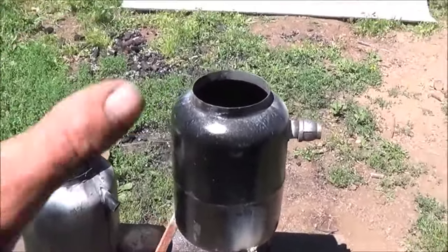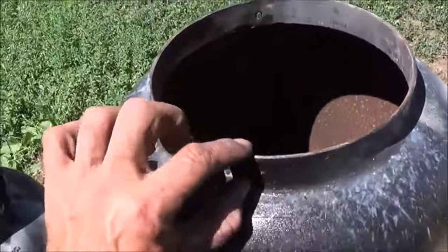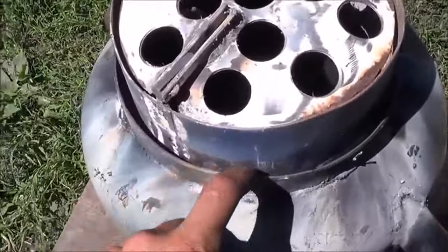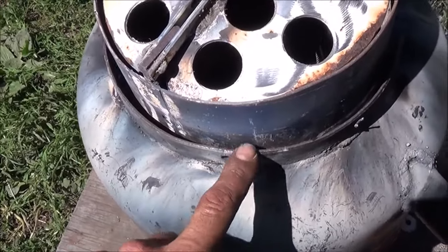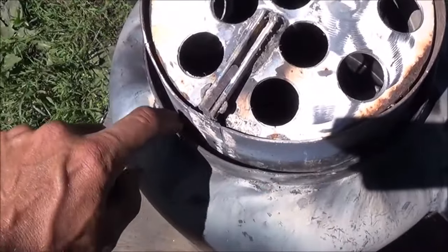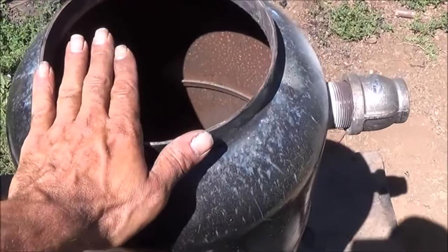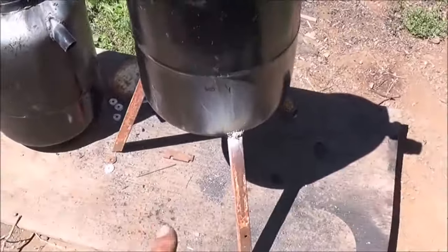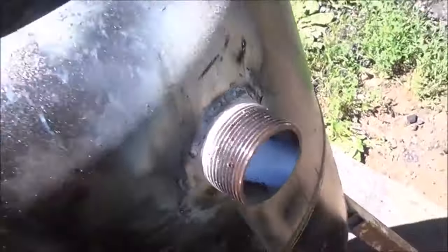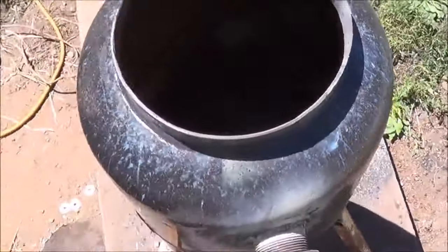We've completed the upper sitting down inside of each other. I've completed all the sealing needed to make a nice seal between the upper and the lower. You can see this rim sticking up right here — that was the old ring on the bottom of the propane tank. The reduction zone itself slides down inside of that ring. I've also taken another ring from the bottom of a propane tank, expanded it and made it wider, and it allows the ring from this one to sit up inside that groove. We'll put some oven and stove door rope inside of there for a really nice gravity-based seal. The lower is ready to go with legs on it. Here's our gas output — it's a 2-inch output with a reducer on it right now, a simple threaded coupler that allows you to go to whatever you want from the gasifier.